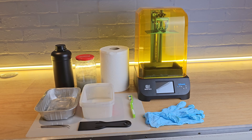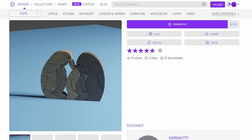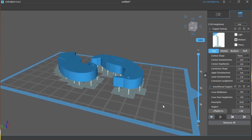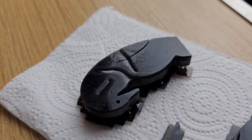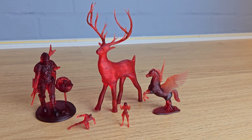Everything I used for this entire review period is shown right here. I then went and found some more models online to test the Alcade with some different shapes. Completely flat sections of models generally shouldn't be aligned with the build plate on a resin printer because it can cause additional suction as the build plate is trying to rise, but I decided to do it anyway. As expected, there were some imperfections on these parallel surfaces. I also found that with this black resin only, I would sometimes see a small seam on one side of a couple of prints. I'm almost certain that a slight change in orientation or a different exposure time would cure this, and I don't believe it was anything to do with the Alcade.